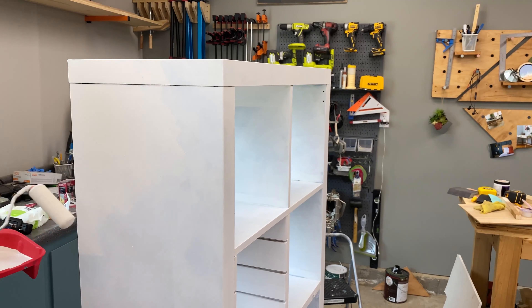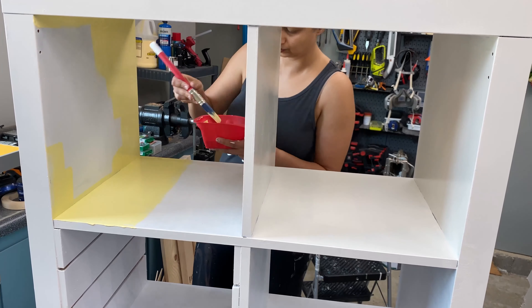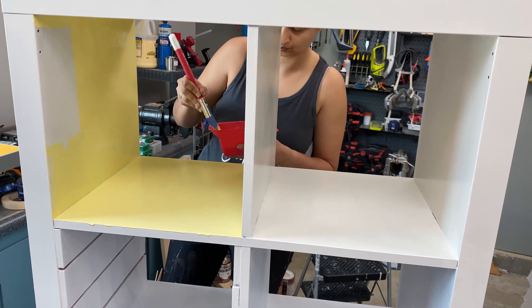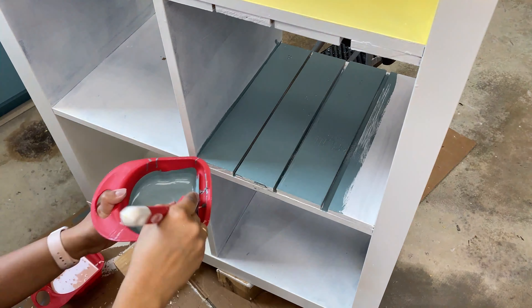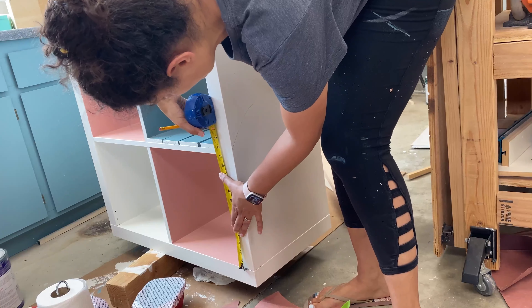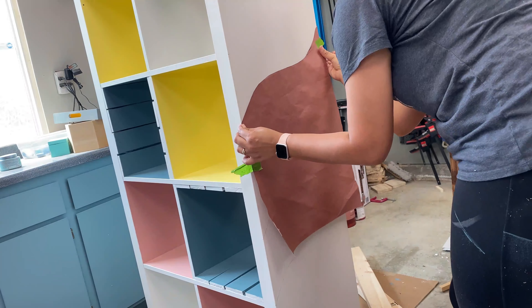For the paint, I painted the entire bookshelf with my favorite white paint, then added more color — yellow, pink, and teal. I'm using regular semi-gloss latex paint with no top coat. I've used this process many times and once it's completely cured, which takes about three to five days, the finish is pretty solid. If you want a less glossy finish, you can use satin or matte latex paint but you'll need to follow that with a satin or matte top coat — I'll link one of my favorites in the description. On the sides I cut paper in a wave shape, used that to draw the pattern, and then added some paint.